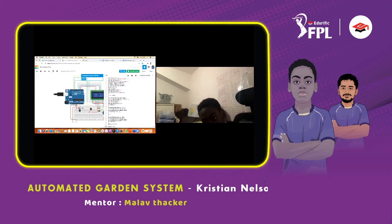Digital write motor. So when it's on, which it says here, LCD.print on, it means the motor will be on, the red LED will be on, and the green LED will be off. That's why it says high, high, low. High just means on, and low just means off. And then the other way around.